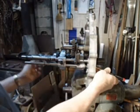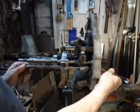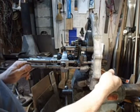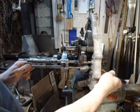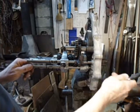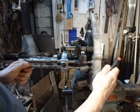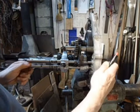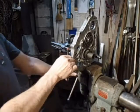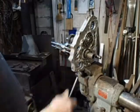Now I can slip this little one. Okay, I put the little one in the hole in that shaft while it's horizontal. When I'm holding up the key, I can push it in horizontal. Now rotate it vertical once it's in there a little ways until it's just barely sticking out the back. It's easier to do this if you lay it on the workbench and tip this thing upside down, and you don't have to worry about all that.